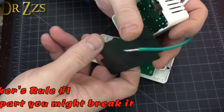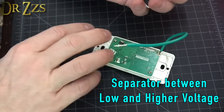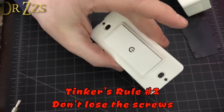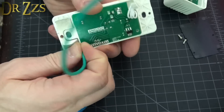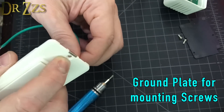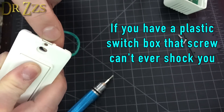The first thing I'm noticing here is that this is just a thick plastic piece. It is separating the 110-volt parts on this side from the low-voltage parts on the other side. This is the ground plate — all they did was hook a green wire up to the place where the screw attaches to hold the switch into the switch box, just in case you have a metal switch box and that screw could potentially give you a shock.